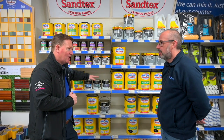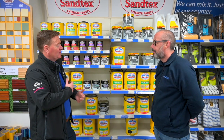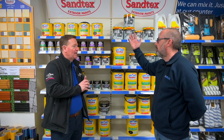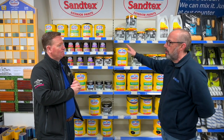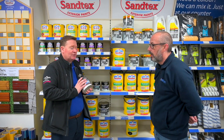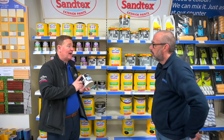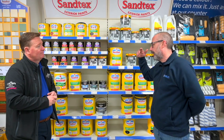If you want something that's going to outlast that, then upgrade to your ten-year exterior gloss or ten-year exterior satin. It's all about preparation — sand your door down, clean it down with methylated spirits. If you've got a hardwood mahogany door with 38 coats of varnish on it and you want to paint it — if you've got varnish on it, a quick rub down with light sandpaper just to break the key and then go back to our PX4 primer. You can put that straight over the top of varnish — you don't need to take it back to bare wood. Just break the key and use that over top. Quick drying — you can overcoat it in an hour.